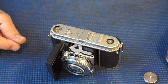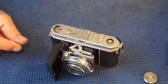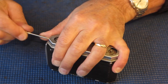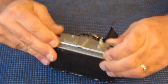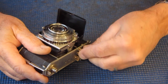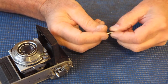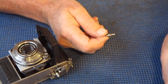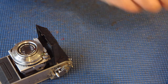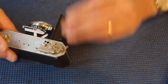I'll sort out the pieces I want to go through the ultrasonic cleaner from the pieces that I don't want to go through the cleaner. Anything with paint on doesn't go through the ultrasonic cleaner because the cleaner will do a really good job of removing paint if you don't want it. Checking the shutter release — sometimes there's a small spacer washer on the shutter release and it's important to make sure you find it and avoid losing it if it's present.